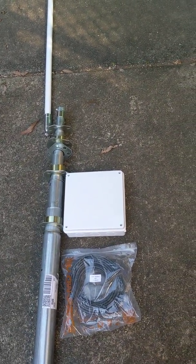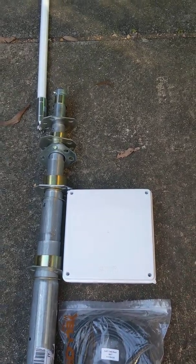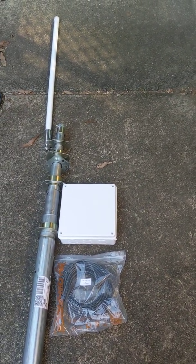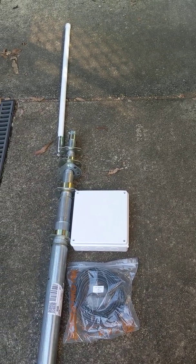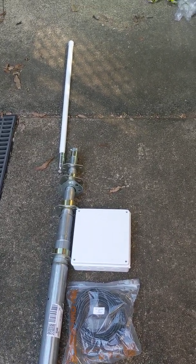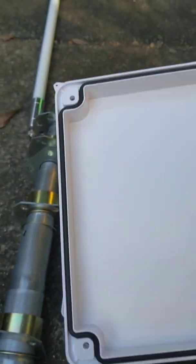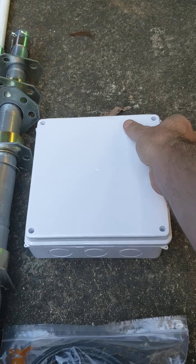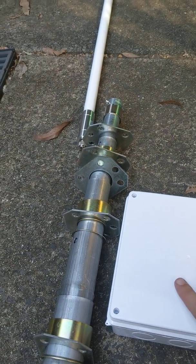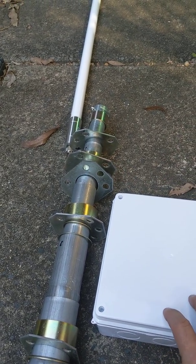The box here is where my miner will actually be housed. The antenna will be at the top, and this box is an IP65 weatherproof enclosure. They are not waterproof in the sense of submersion, but this is the industry standard for keeping electrics safe from weather, even a direct jet of water. Here in Queensland we do have pretty major thunderstorms, but I feel we're going to be very safe. This will be mounted at the top of the pole, approximately one metre down from the base of the antenna, held in place with U-clamps.